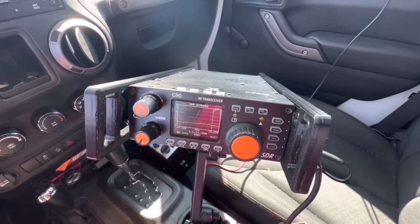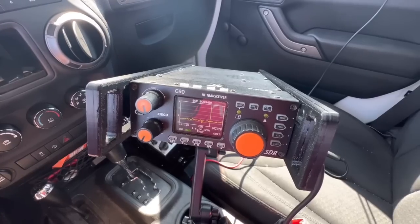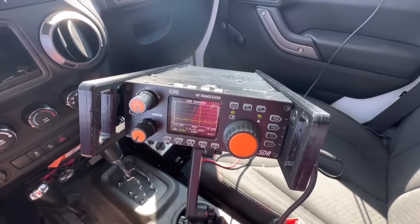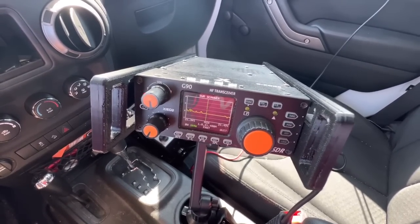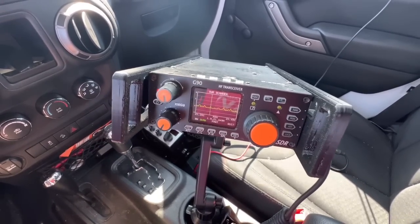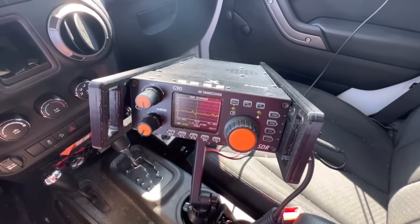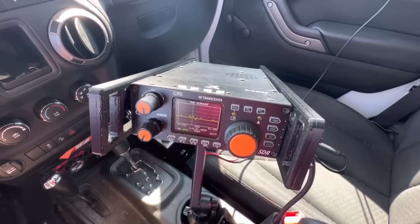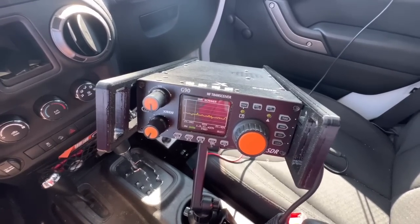Here's 20 meters as well — that is 1.6. I'm going to use my ATU, but you could get away without it if you wanted to. And 17, 15, and 12 are all hovering a little over 2-to-1. Tuner time — but we did exactly what we're trying to do with the 4-to-1 balun: get the feed point impedance to a level where we can tune it with as little loss as possible. That looks pretty good. Let's go see what's happening on the bands.